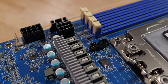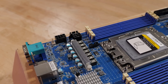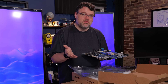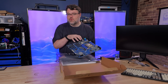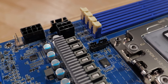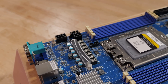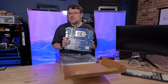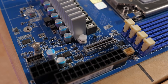This motherboard also features an optional TPM 2.0 header. You have to get Gigabyte's breakout header for that. If you want offboard TPM, which may be important if you're an Unreal developer, check out our Unreal development on Threadripper Pro video. There may be a system stutter on Windows with TPM — Linux of course doesn't care. This motherboard supports four onboard GPUs; a GPU can draw up to 75 watts through the PCIe slot. It does have an extra six-pin 12-volt power connector, and you will need to connect that if you intend to power four GPUs. The two eight-pin connections can carry 400 watts each, but given the CPU is 350 watts TDP and can peak a little over that, you probably want to connect both.